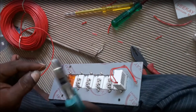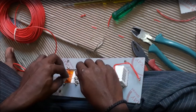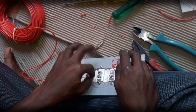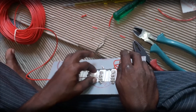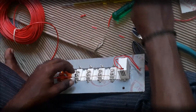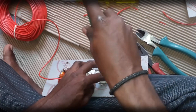This ensures the copper wires don't get separated from each other while giving a connection at the phase-in of the switchboard. Loosen the screws of phase-in of the switches with the help of a screwdriver — these screws are at the bottom of the switch, as you can see in the video.